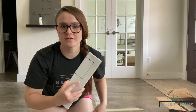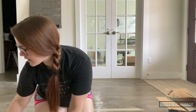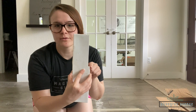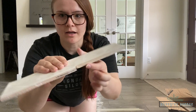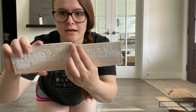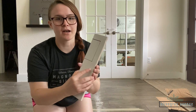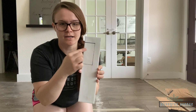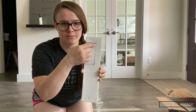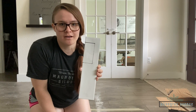We're going to finish up the tile today. I was waiting because I had to make two special cuts around the outlets. For a cut like this, you score it and go along the back side — cut with the top up so any extra cut is on the back and won't show. For the outlet openings, I'll make cuts along where the outlet needs to go, then use my Dremel to score along the back edge and break it off for a clean cut.